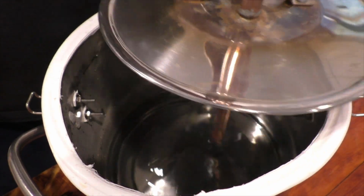So you may already know this, but adding a thumper to your still increases the level of risk quite a lot, because when you add a thumper, you're closing that boiler off. You're making a closed system for that boiler because your outlet tube is underwater. So because there's that new layer of risk, there's some decisions you need to make on how to reduce that risk to protect yourself and your equipment.